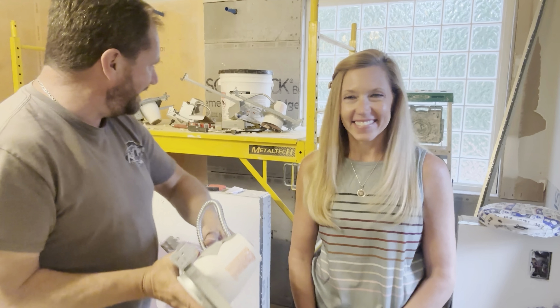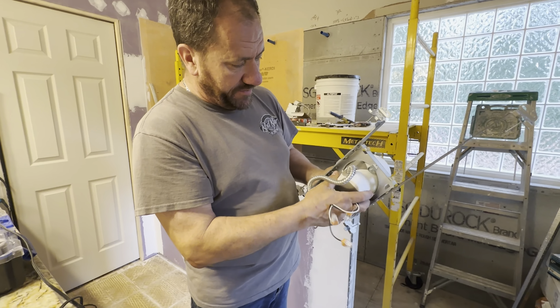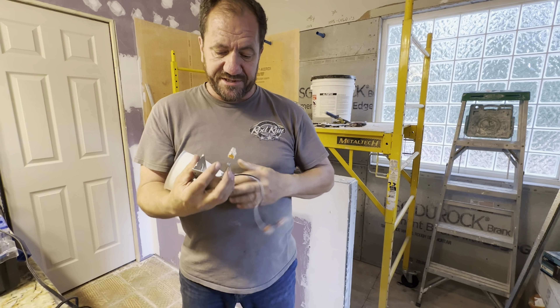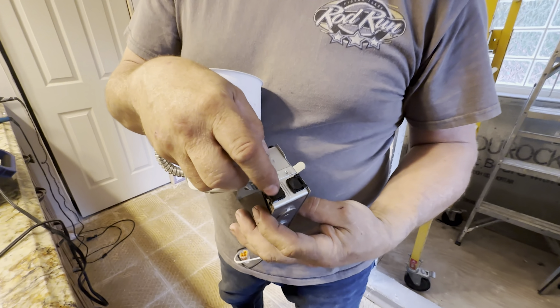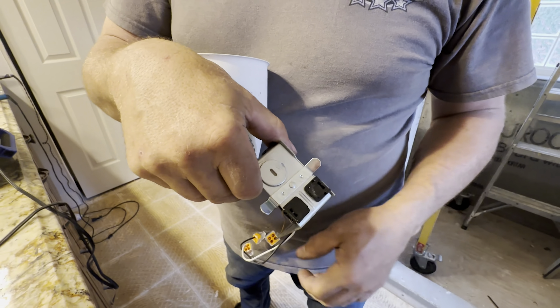We're not going to keep the housing part — we take out what holds the bulb and what holds the electrical connection. We're going to rebuild the box with the side plates. I like these can lights because they've got little quick connects — strip the wire, put it in, no need for wire nuts. They've also got little openings where the wire goes in, so you don't need half-inch or three-eighths-inch knockouts.